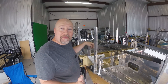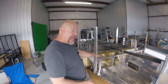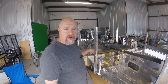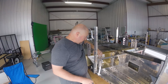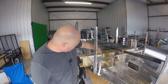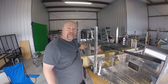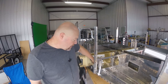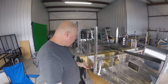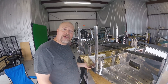What you just finished watching me do was a bit of a pain in the ass. Basically it's all around these heavy-duty steel landing gear support struts. This one's just laying in here right now, but these will bolt across the top here to this bar, and a couple of these bolts actually bolt all the way through to the back spar. Then there's six bolts down below as well as two right here and four right here.